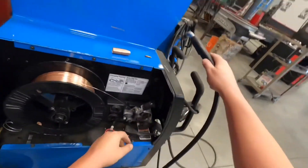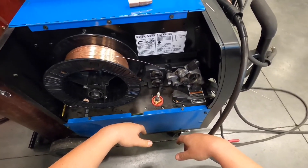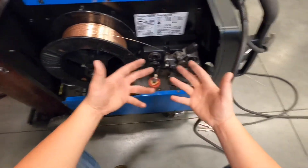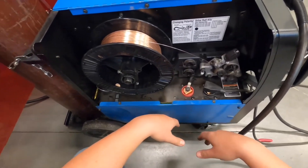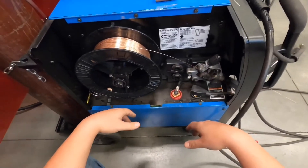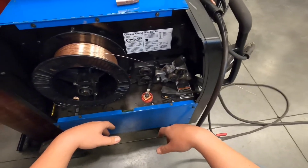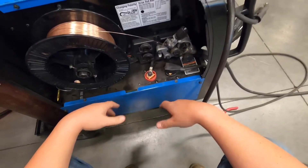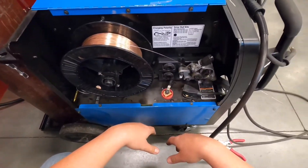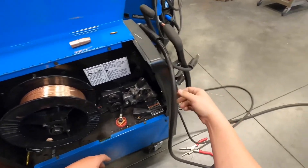On electric shock — unless you're welding in a puddle with damp clothes or touching bare wires, it's pretty tough to get shocked while MIG welding. Make sure you're welding in dry clothes, 100% cotton, leather boots, and leather gloves. This machine runs on 220 or 240 volt through a 55-amp breaker — more than enough to ruin your day. If you grabbed the prongs you might blow out part of your hand or arm if you're lucky; if you're unlucky, you're dead.